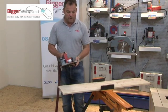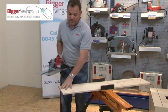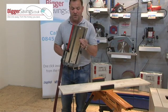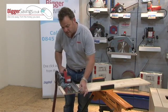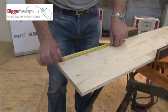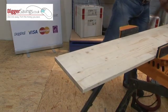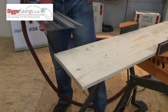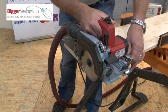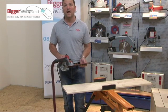If you want to crosscut a board — whether it be a floorboard, skirting board, or laminate flooring — and you want to cut your material square, by setting your pointer at zero, that gives you a guaranteed 90-degree cut when both stops hit the front edge of your timber. Simply take one measurement of length, mark it, and your cut line gives the red edge. You've cut perfectly square at 90 degrees.